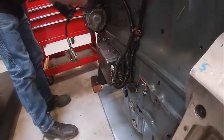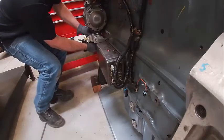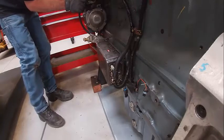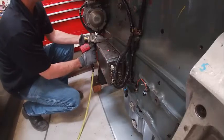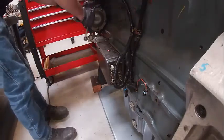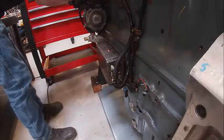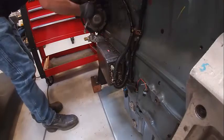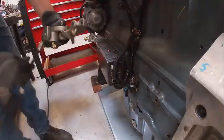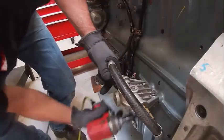We're going to install our fuel filter housings. Let the bolts go in here. Fuel actually comes in up here off this housing. Get those tightened up and then this hose goes here. Those are going to torque to about 45 foot-pounds or so. This would be our primary fuel filter here. Before I put my fuel filter on I would go ahead and prime it and pre-fill it. It's also got a fuel temperature fitting here.